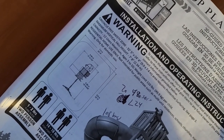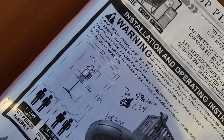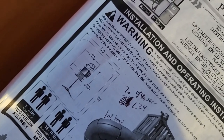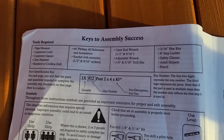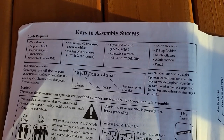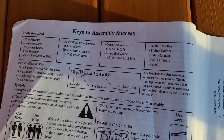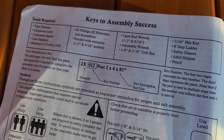It covers a 24-foot by 32-foot play area, though I ended up going with a 24-foot by 28-foot area. Here's a look at the different tools required. Every one of those is definitely needed. I would recommend using an impact-style battery-powered screw gun — I used a DeWalt, worked great. One thing to mention: it does come with an eighth-inch drill bit, but a 3/16 drill bit is needed and you will definitely need to buy a long one if you don't have one.